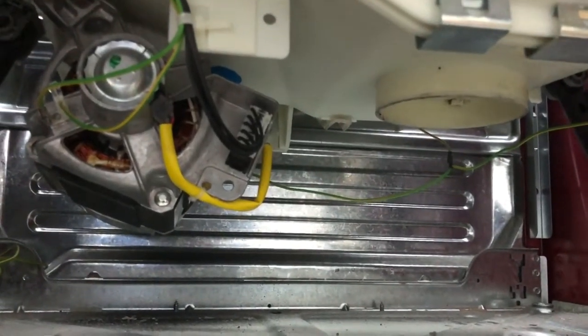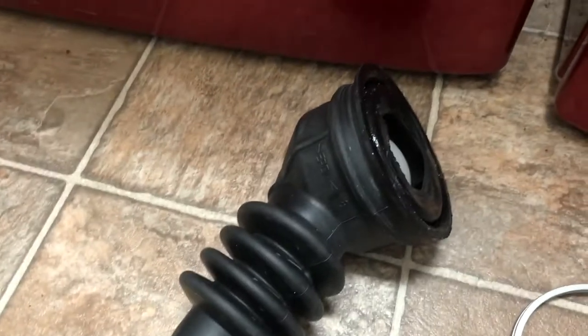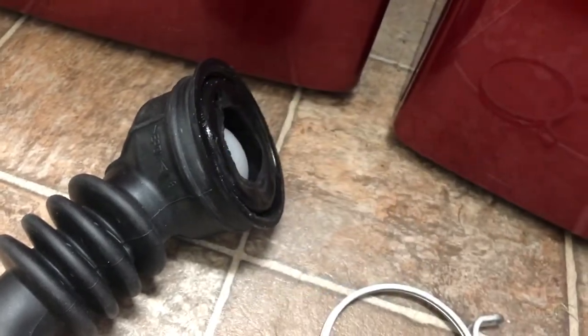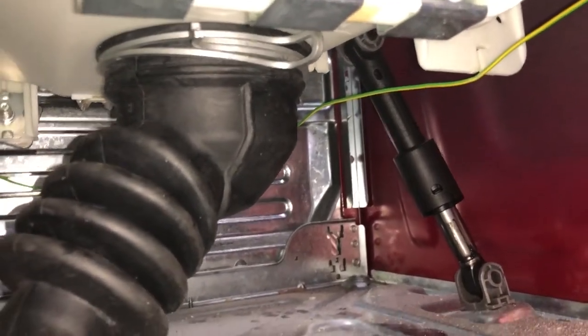Okay guys, we're going to start clamping back up. We're doing fantastic — the back hose is all clamped in. We have a pinch clamp here. You need a tool called a poly pipe pinch clamp tool. You just flip this down and it should sit in there. Don't force anything — if it doesn't go in easy, stop or you'll break it. It's all plastic. Ensure everything is pinched, crimped, and the way you want it.